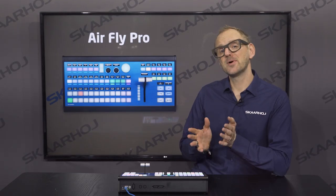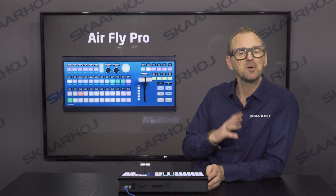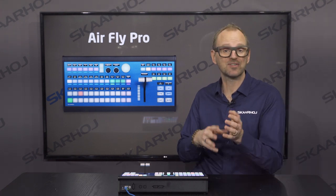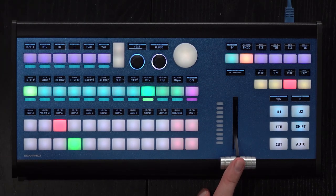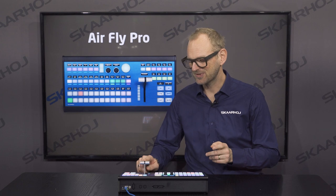The AirFly Pro has a 12-key bus row with four-way buttons and OLED legends. It also has RGB multi-level metering LEDs for VU, for state indication, and for tally. And you get a nice hall effect T-bar with an RGB LED bar just next to it.